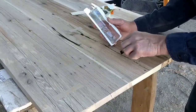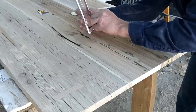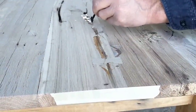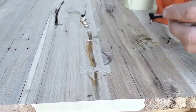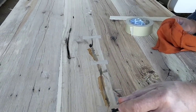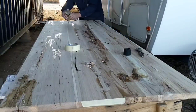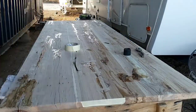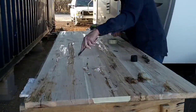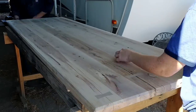This wood has a lot of character — lots of cracks that need to be filled. There were some wood-boring insects that had left tunnels through part of this wood, and all of that needs to be filled in. Even though this is the underneath of the table, I want to get it filled in so that it further stabilizes the tabletop. Here I'm using some five-minute epoxy to fill up one of the larger cracks. The epoxy is great for filling in large gaps, but it's fairly thick and doesn't flow well, and sets up really fast, so I only used it for the really big voids. For the smaller cracks, I used either superglue for the really small ones, or a custom putty that I make myself. The thick superglue soaks into fine cracks and really seals them up. After everything had dried, I did a rough sanding and was ready to flip the table back over to the front side.